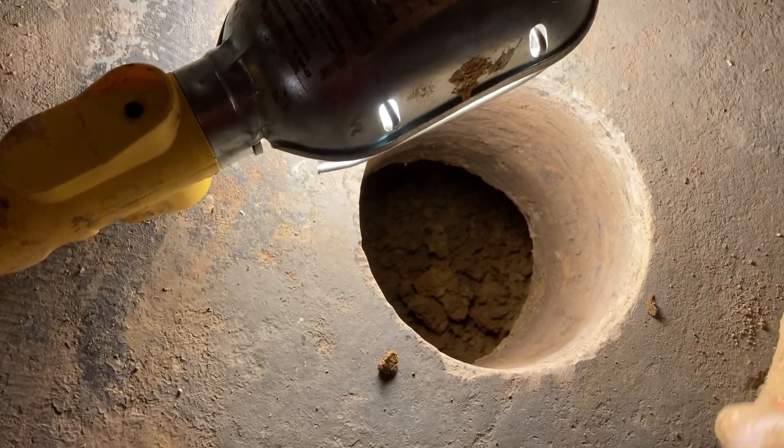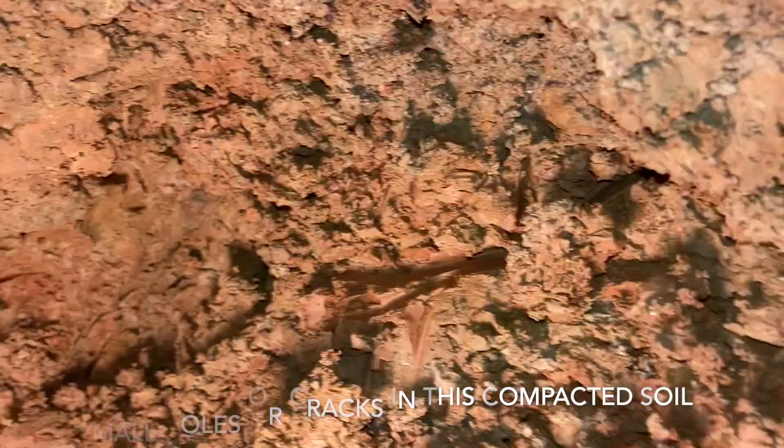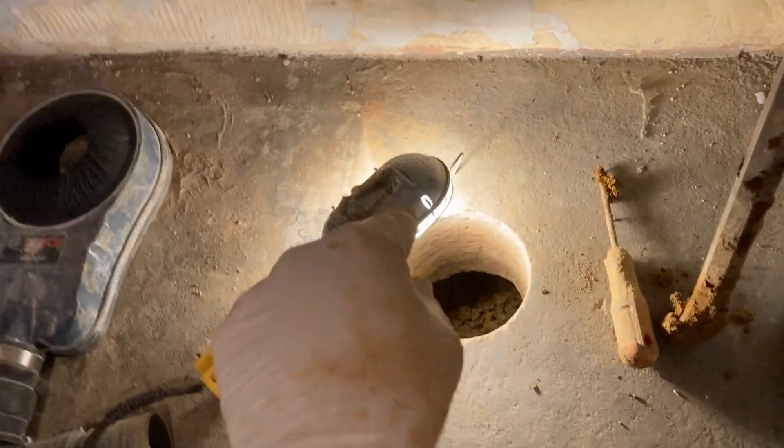Back to water — I see moisture as a good sign because water seeks its lowest point. If it's moving, it's creating little pathways, and little pathways allow for airflow. This is the toughest part of the job but it is the most important. Concentrate a whole lot on your suction points, because once the pipe's in, if it doesn't work out, you don't ever want to ask yourself, 'Could I have put more effort into that suction point?'